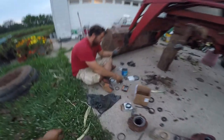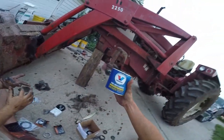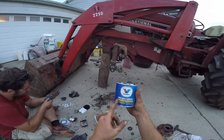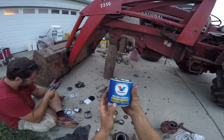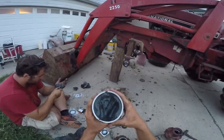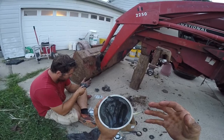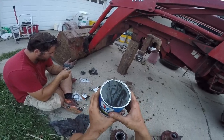We can see how dirty and greasy Brad is. Let's see what we like to use for grease - this is the Valvoline for Lincoln Mercury. Keyword: Ford Mercury is no longer in existence, they closed that down. We have our luxury brand - luxury grease. Molly-fortified multi-purpose: disc brake, wheels, steering linkage, chassis, everything, universal joints. It is a very real petroleum grease and the oil doesn't separate out, which is usually a good sign - decent grease that's not going to get hard on us.